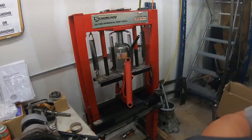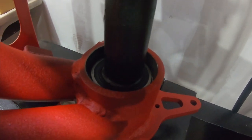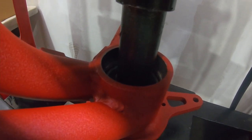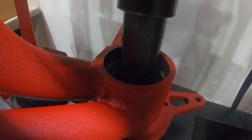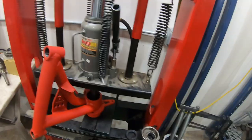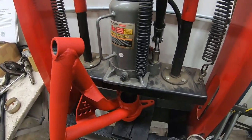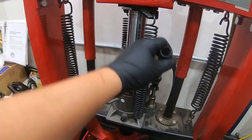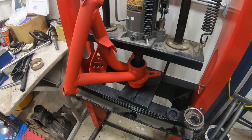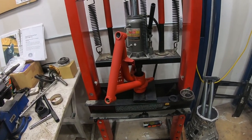I'll show you what's going on so you can get a better idea — tracking 100% straight. The Harbor Freight air-over-hydraulic bottle jack is amazing for presses. You don't have to sit here and crank for an hour — you just pull the trigger and step away. You just have to be a little careful with it because it will get away from you. Now all you've got to do is tap the seal in and assemble it.